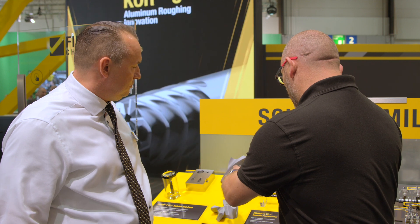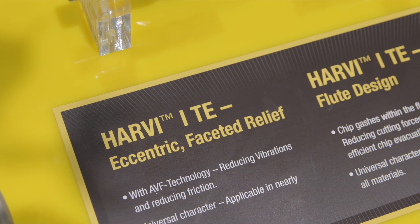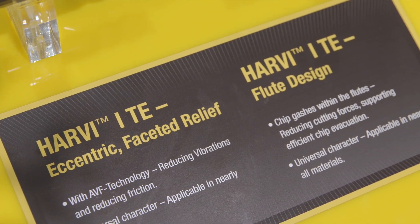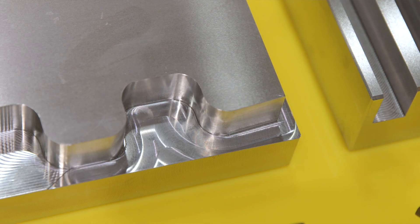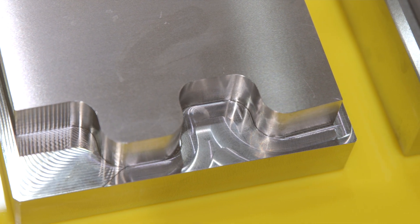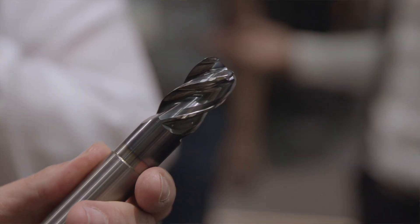And this is a great model — it shows it off well. It's got this new eccentric relief. Yes, this relief style makes it very unique and very versatile with regard to the type of materials. It reduces friction, it reduces vibrations, which makes it an excellent tool for everything to do with side and shoulder milling — independent of whether it's dynamic milling with smaller depth of cuts or really heavy cuts.